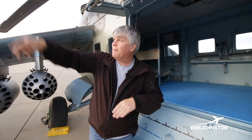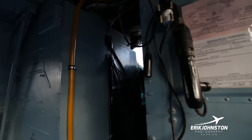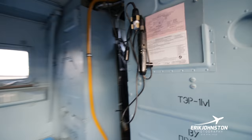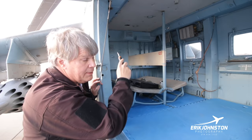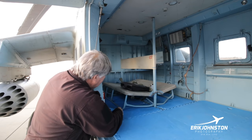So, the crew compartment. You see you've got a fuel line running here, and that's either a vent or a drain line from the top going down. We have fuel tanks in here, so the one and two you saw up top are the service tanks, the odd-even, so the odd, number one, is on the left, and the even, tank number two, is on the right. On the back of the crew compartment here is a vertical tank. That's tank number three. And then it flows into tank number four, which is kind of in the back half. And then tank number five, there's an interconnect here.